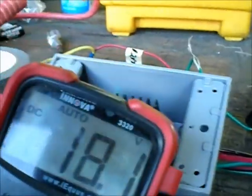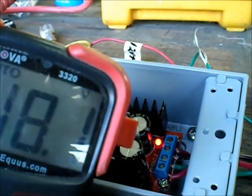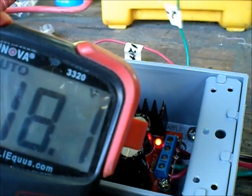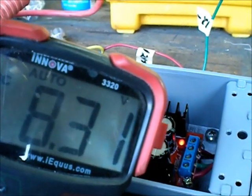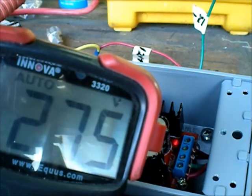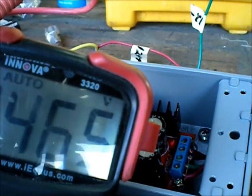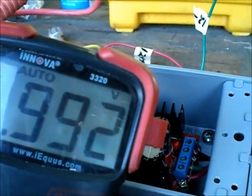You can watch the voltage fall, and that light will stay on. I'm going to disconnect the battery, and the light will stay on and the voltage will fall because the caps are charged. The voltage is dropping — 13, 12. That light will eventually go dim and go off. That's why they work so well — they've got two pretty good-sized capacitors in there, and they've got nice voltage regulators and some nice heat sinks. And the light's off, now it's down to 11 volts.